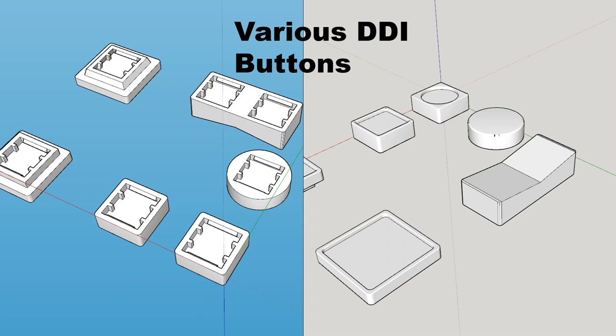I also had to print a lot of DDI and moving map buttons — at least 25 switches per display, so around 100 buttons total. The DDI push buttons are circular recesses, the moving map buttons are square recesses, and the UFC buttons have a numeric keypad layout with autopilot selections and IFF. For the moving map display rocker switch I had to create it from a 6x6mm micro switch, smaller than the 12x12mm switches I used in my first cockpit.